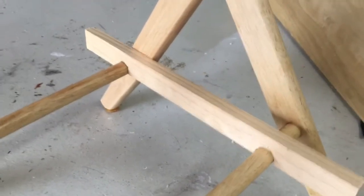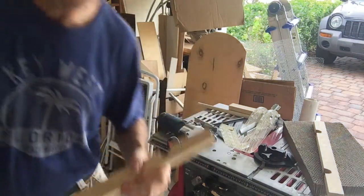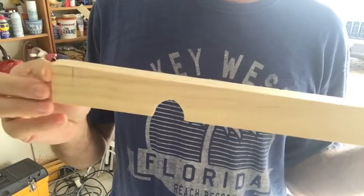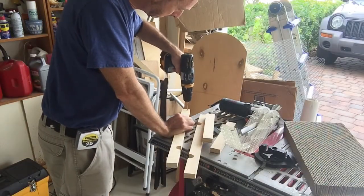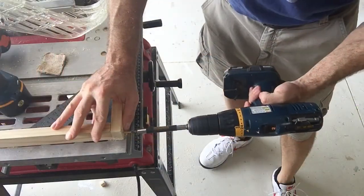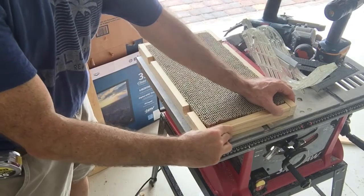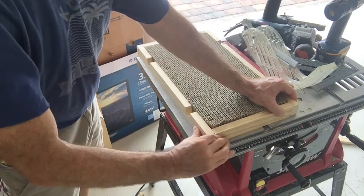That's going to work out pretty well. What I'm going to do is screw into this beech wood up into the pine — that's basically how it's going to sit. Now I'm actually going to pre-drill a couple of screw holes on each side of the longer pieces for my cross members for this box.